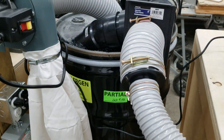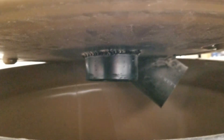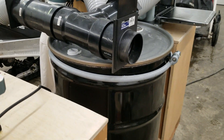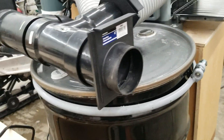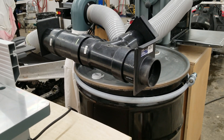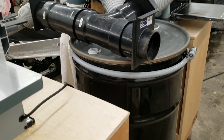The biggest disadvantage of the cyclone is that because the pipes protrude through the lid a little bit, it makes it a bit of a pain to remove the lid and get the can out. But it does work — if you have a hand it's way easier, or use a two-by-four or something to prop it up. The four-inch, 600 CFM is more than enough for any of this. With the auxiliary port on the back end here, you could run a miter saw, table saw, track saw, whatever — it's just nice to have extra dust collection around.